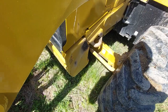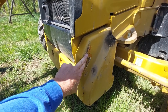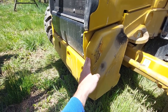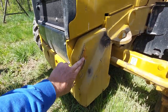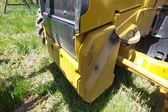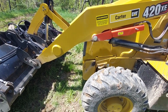Another issue I was one of the first to report to CAT: this is your big counterweight here, but there is very little tolerance between the boom and the counterweight when you're in the dig position, so it scrapes and rubs right here. The other side isn't doing it right now, and what we've discovered is the counterweight is a little off-center on the machine. It can only move an eighth to a quarter inch to center up, and I'm not sure if that'll stop the rubbing or just make it rub on both sides a little. Either way, that's something they need to come fix — I noticed it the very first time I took it out.